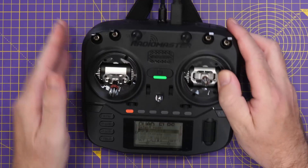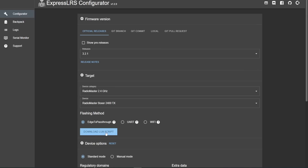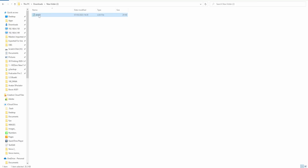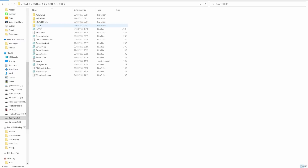But there is one more thing you may need to do, and that is update the ExpressLRS Lua script — the app that allows you to do the configuration. Plug in the USB again, but this time select the storage option to allow us to access that onboard SD card on our computer. Go to the ExpressLRS configurator and you will see a button that says Download Lua Script. This will allow you to download the latest version available today — version 3. We're then going to copy that latest Lua script file and place it on our SD card. Open the SD card drive on your PC, go into the scripts folder, then into tools, and here you would replace the existing ExpressLRS Lua script. Mine is already version 3, however there may be new versions available in the future and that is how you would update it should you need to.